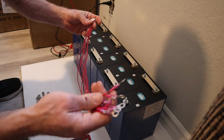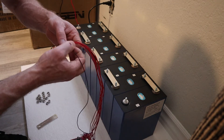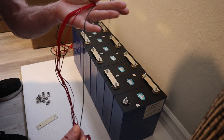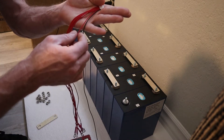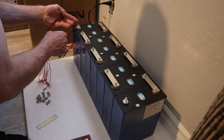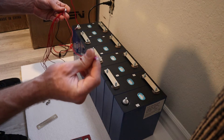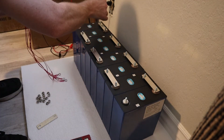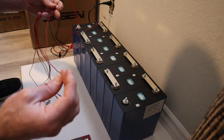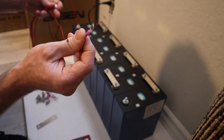The next step is to connect your balance lead. You will see this is an 8S, so we're going to start with the black cable. You have a black cable here — you're going to start with this one and then move on to the next one. Let's put the black negative on the far side here, and then the first red will be your cell one — it just goes on the positive. Make sure when you're connecting these, the little connectors will have a flat side — make sure you put the flat side down so it makes a nice connection.